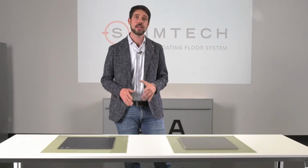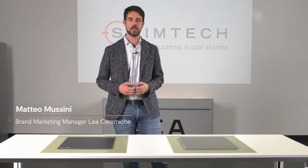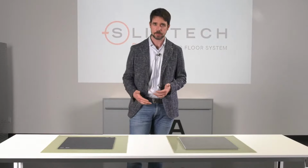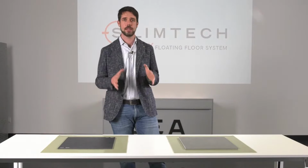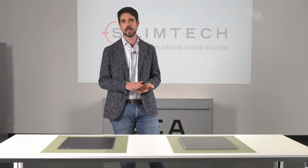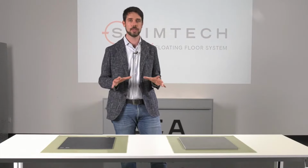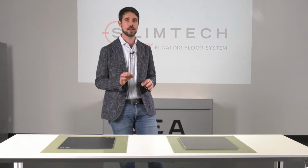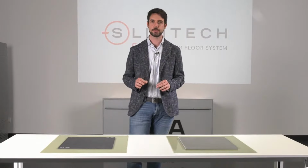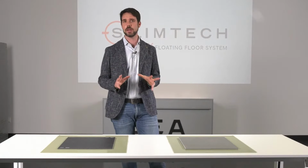So welcome back. Together we watched the video of the installation of the Slimtech Easy system across the three phases. We saw that the silent mat was rolled out, then the film was removed quite easily. Then we place the Slimtech 5 Plus material that sticks to the surface without being glued. So it's very simple also for the installer to make some adjustments while he's laying the material. 2 mm spacers, and then we apply filler, the silicone for the grouts between the different materials, the different sizes.